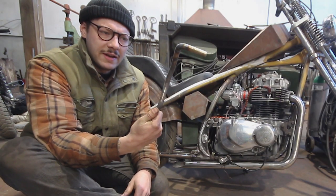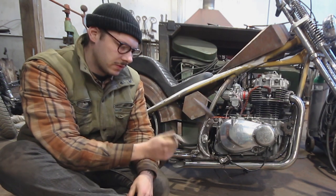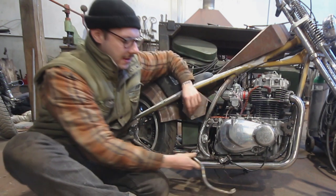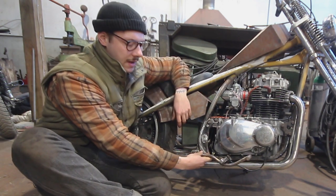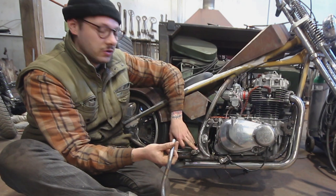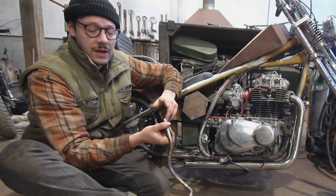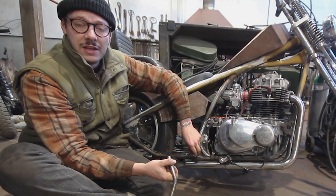Now I've got my brake arm all bent up — it's looking pretty wiggly and a little bit weird, but I think once we put it on there and polish it up it's going to look pretty smart. So that's going to sit there just like that. My next step is to perform one of my TIG welds and attach that onto the pivot. Before I do that I'm going to have to prep this area by shaping it so it's a nice snug rounded fit against our pivot.